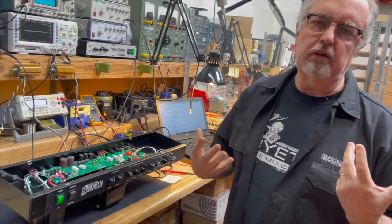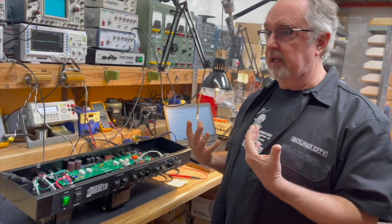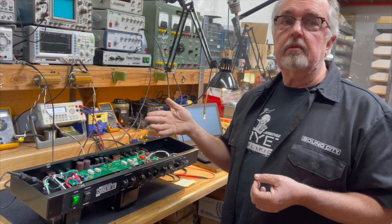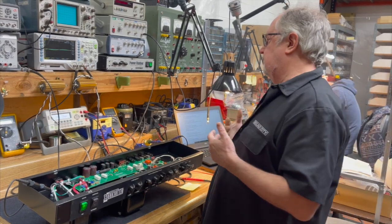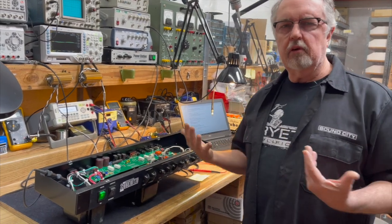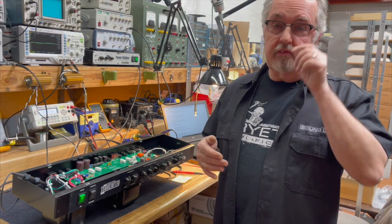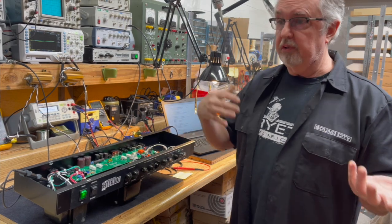We're going to talk a little bit about current draw. We started to talk about it in the intro. On a variac, they're rated in VA, volt-amps. VA is basically an equation, volts times amps, which is watts, but they're usually stated in terms of how much current they can pass through to whatever you're plugging in, or watts or VA. Most of them use VA. So you'll see any one of those ratings on the front of any of these variacs. It's really easy to convert power to current to voltage using Ohm's law.